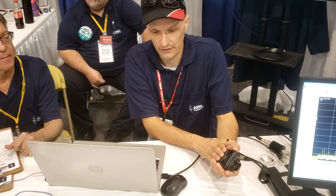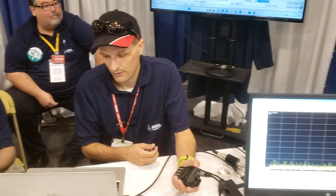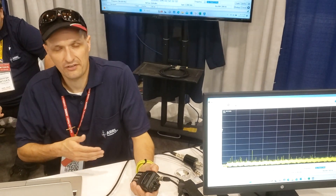For your radio, our first test would be on the 2-meter band, and we set it usually to high power. On the screen here, we will see a fundamental frequency. We will also see harmonics. Usually nothing to worry about if you see harmonics — we just want to make sure the harmonics don't get too high, because if they're too high, that means your radio would not be in compliance.